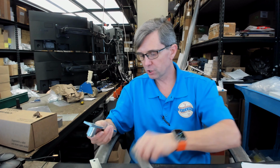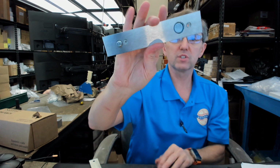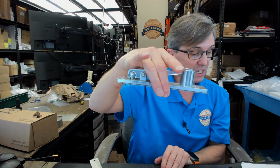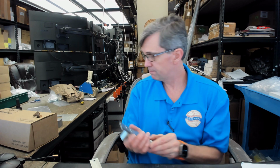Then the header portion will be a finished plate. It's going to be available, of course, in all of the different architectural finishes. This order was placed as 652, which means satin chrome, but it technically means plated satin chrome over steel with a lacquer applied. The finished plates here, they're stainless, but the factory's not calling us to say, hey, we're not going to do it in 652. Is 630 okay? It is.